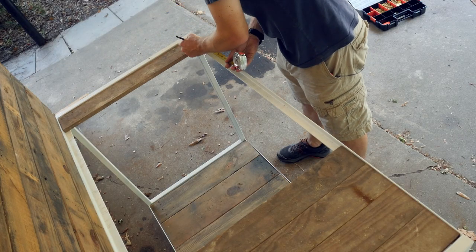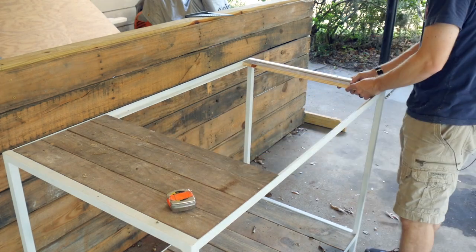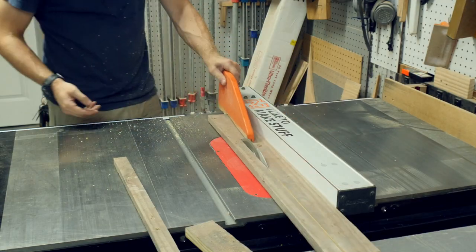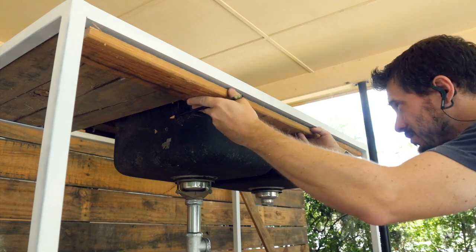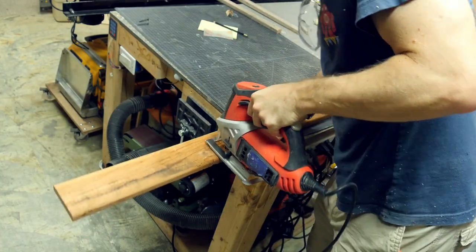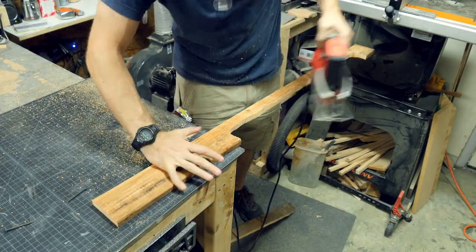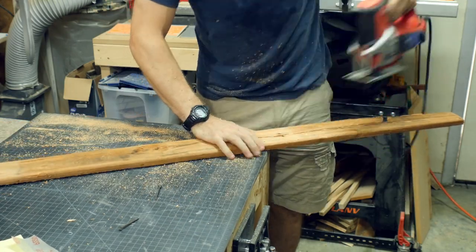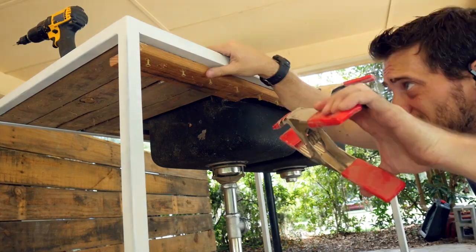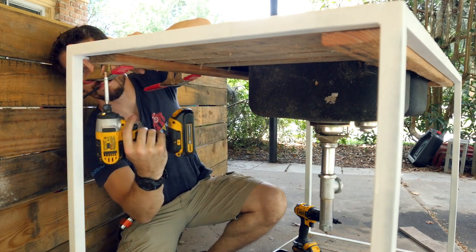I did basically the same process for the top, but there was going to be a big gap where the sink would go. I ripped a couple of the pieces on the table saw to make sure that the gap was big enough for the sink to fit down inside. Once I tested it and the overlap was okay, I had to cut some pieces to go on the front and back side, and also rip those down to fit in the gap. The curved area of the sink needed to be removed from these pieces before they could go into place. I roughly marked out the width and depth of where the cuts needed to be on both pieces — they're not the same from front to back — then used the jigsaw to cut them out. They didn't have to be pretty because this is going to be underneath the whole table; the sink will overlap these ugly edges so you won't see them. I pre-drilled holes and added screws, then held these in place with clamps and drove in all the screws, making sure to squeeze the top panels and cross pieces together so the joints were tight.